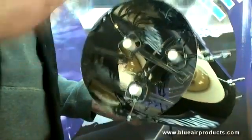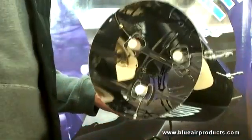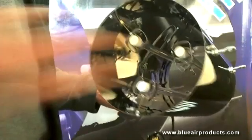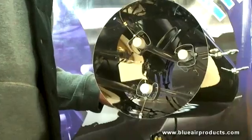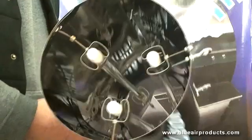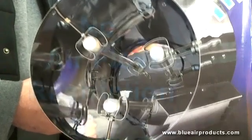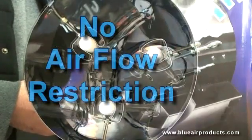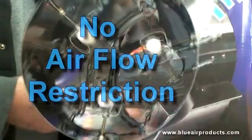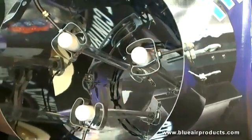When we're talking about CFM and the Big Blues, I don't care what fan you put on here. You want to put 2,000 CFM, or a fellow from Colorado called me and said he wants to put 4,500 CFM through a Big Blue. What I want you to remember — the thing we're always most concerned about — is plant condition or plant respiration. We want enough fan movement to exhaust the heated air from your growth space and bring in fresh air, but we always want to remember what's best for the plants. If I can get proper air flow with a 5 CFM fan, great. If I need 4,500 CFM, then that's what you need for proper plant conditioning.